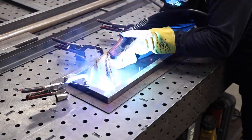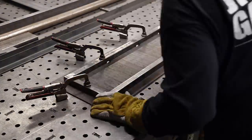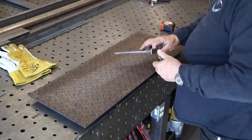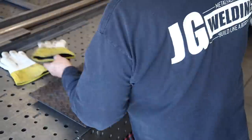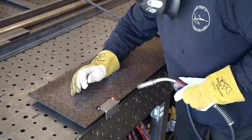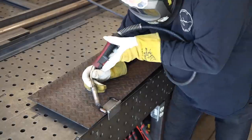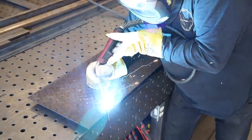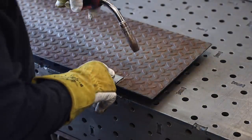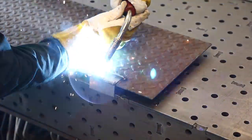Put on a couple of hinges — just standard regular gate hinges. Not getting real fancy; this is kind of the rugged look that fits what we've got going on. I came in about three inches on either side. The spacing for the hinge is kind of your own discretion, but this gave a nice even balance.